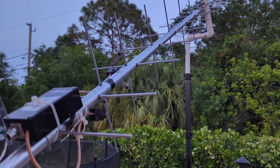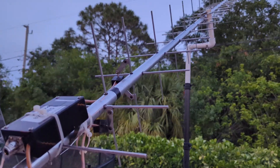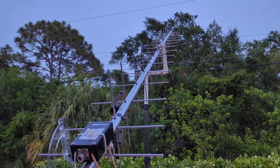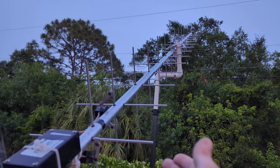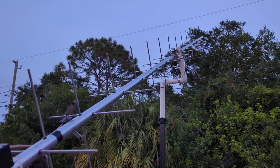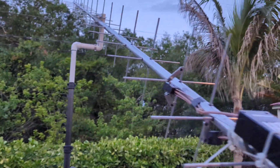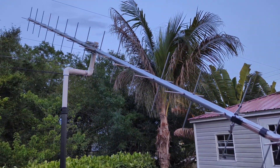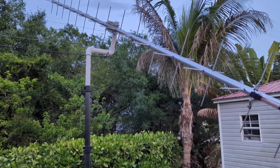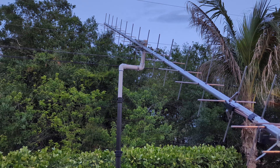When I had this for testing the other day at like zero degrees, John KF4PFI was in Palm Bay. I switched it to vertical first and he could hear me when I was vertical. When I rotated this whole thing 90 degrees to horizontal, he was gone — even with maximum power, he was gone. Same thing with a repeater in Stuart about 40 miles away. When I was vertical I could hear the repeater; horizontal, I only had like an S1 with the preamp and like 15 degrees each way off that repeater — it would just totally wash out.